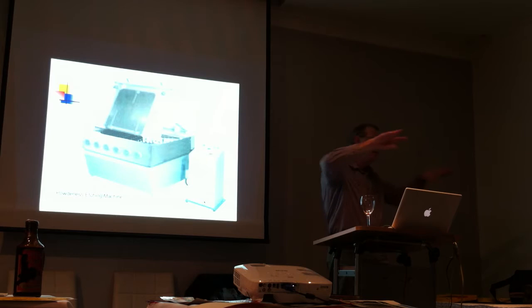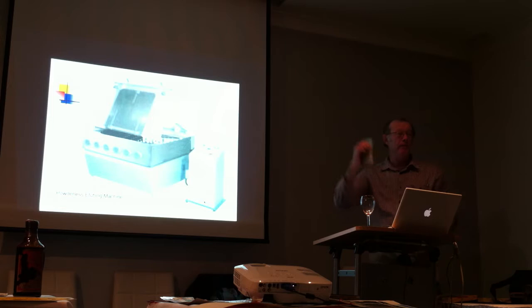Well, how paddle etching machines work, they had an emulsified oil in the solution, and depending on the paddle speed and heat, the oil would go to one side, protect the side of the image, and the acid would eat straight into the plate. So you can sort of see there, on there you probably get quite a few millimetres depth, depending on how long you left it in there. And it would just eat straight down in it, and that's how you would get a raised image.